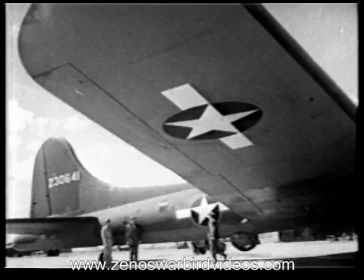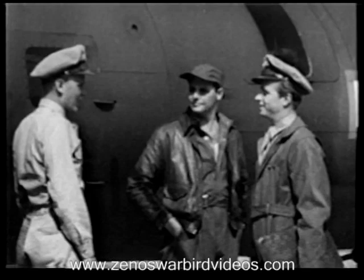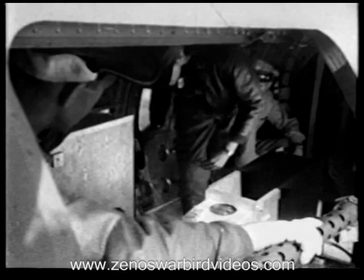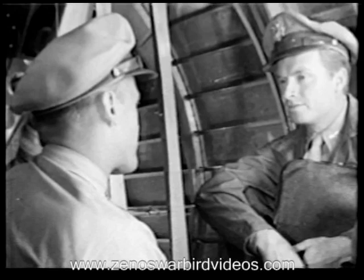Okay, for 3 and 4. Does that complete the circle? Yeah. Let's see how she looks inside now. We'll start with a tail oleo. Is she like the others? Not quite. This baby should show about 2.5 inches of shiny cylinder. I see. Notice the equipment stored in this section.